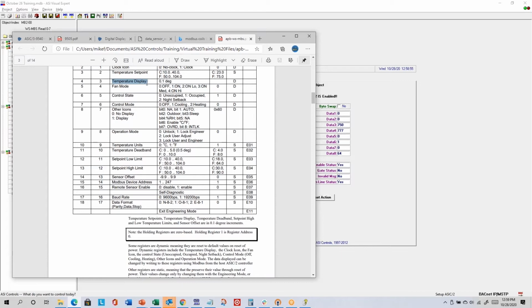One case of that might be where you have a stainless steel plate sensor in a refrigerated storage area. And on the outside of the refrigerated storage area, you want to just be able to show people what the temperature is in the refrigerated space without them having to go in and read a sensor or take a measurement. So then you could read that value from that stainless steel plate sensor in the refrigerated space and then write the value to the Modbus wall sensor that's in a more comfortable temperature environment so that somebody could just make sure it's not getting too warm in that space.